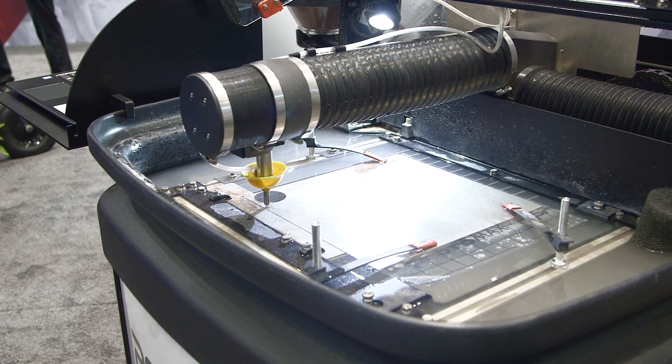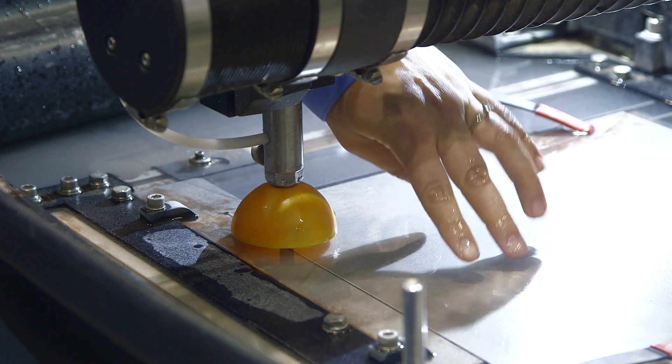So tell me a little bit about the size of it. It's a 12 by 12 cutting bed and it's on casters, so it's easy to move around if you need to. It can fit in small spaces — we have somebody that puts it in their kitchen. It could virtually go anywhere you can think of. It runs off a single phase 240, 30 amp, so at home you could take your dryer out and plug in a Protomax.